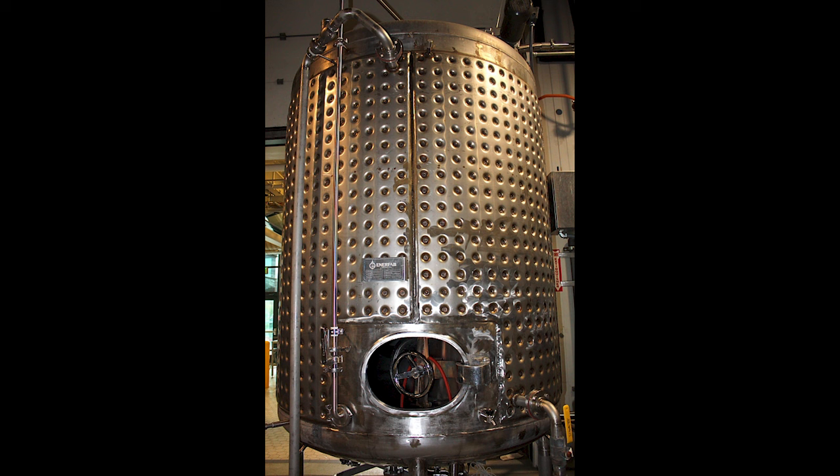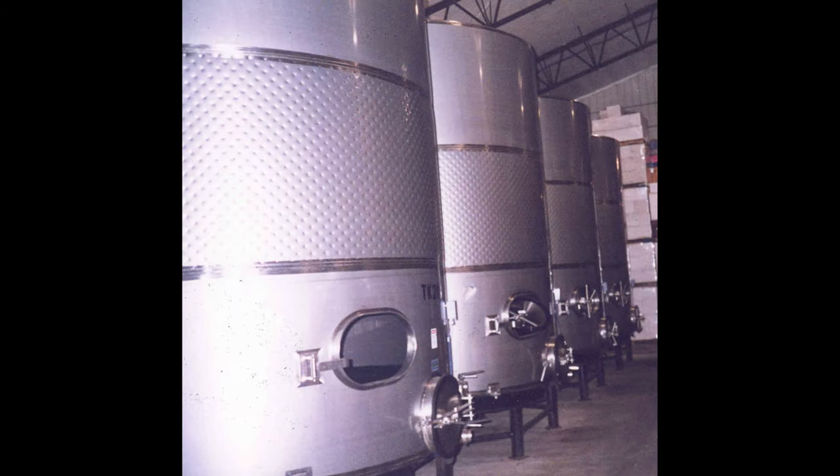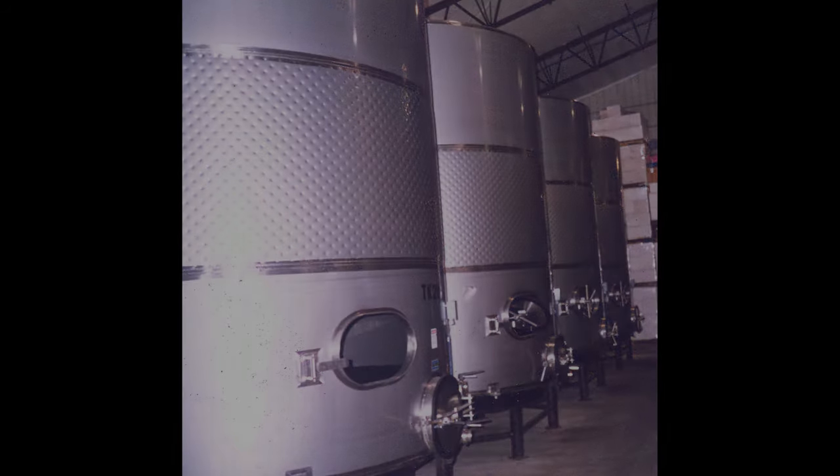For instance, I inspected a facility that constructed stainless steel tanks used for wine and beer fermenting, with welding and cutting operations going on all over the place. After the opening conference, I'll ask: what am I going to see when I walk out into your facility? Where is it located — throughout or in a certain area? And of course, am I wearing the right personal protective equipment? You want to make sure you've got safety glasses on, because there'll be arcs being struck and humans naturally turn their head and look when they hear one.